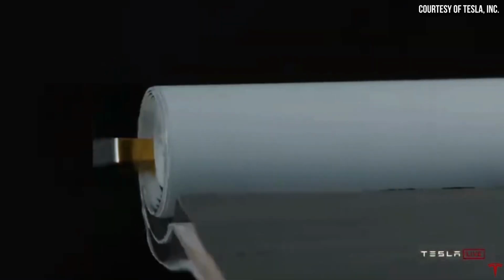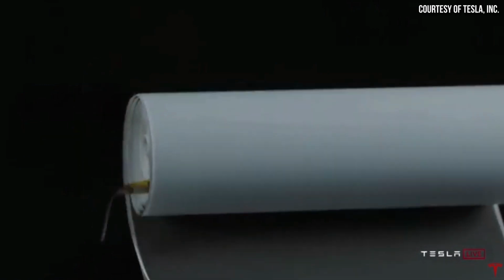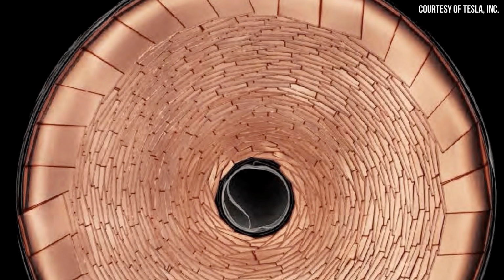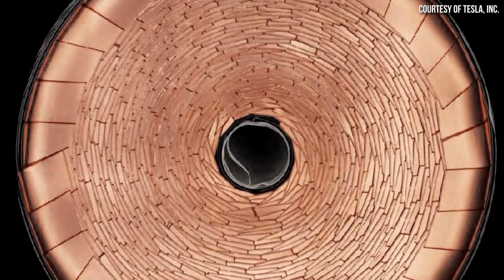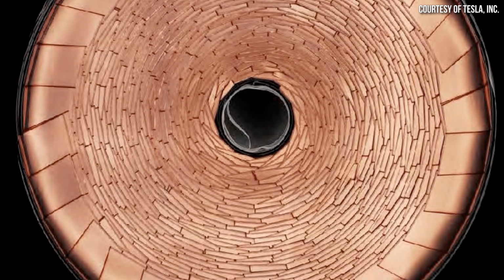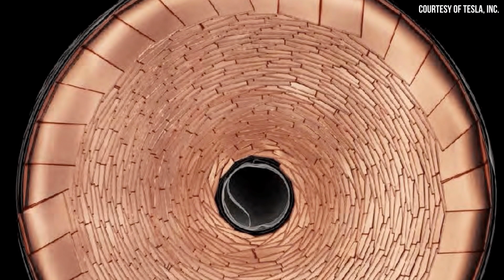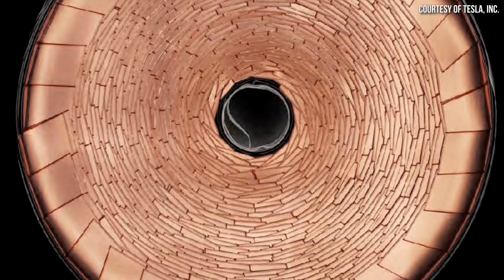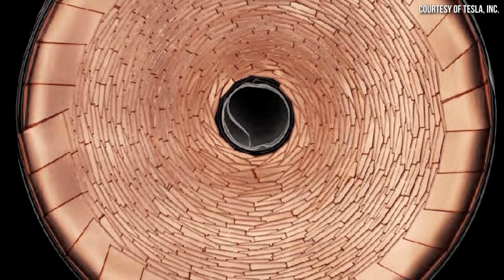A normal battery design has 2 or more tabs which connect each electrode to the respective current collector, at least 1 tab connected to each battery electrode, for instance. Whereas Tesla's tabless design has somewhere around 1,000 flags or so that must be folded over to create the electrical connection with each respective current collector. Now, during the phase when the flags are being laser cut, Tesla's machinery uses controlled and directed puffs of air to fold over the flags in the proper direction. In addition, during the winding process of forming the battery cell jelly roll, these folded flags are further pushed down or reinforced with a ceramic finger that runs along the edge of these rolls. While this process generally works well, sometimes these flags can end up being bent the wrong direction and bend down into the center of the jelly roll.